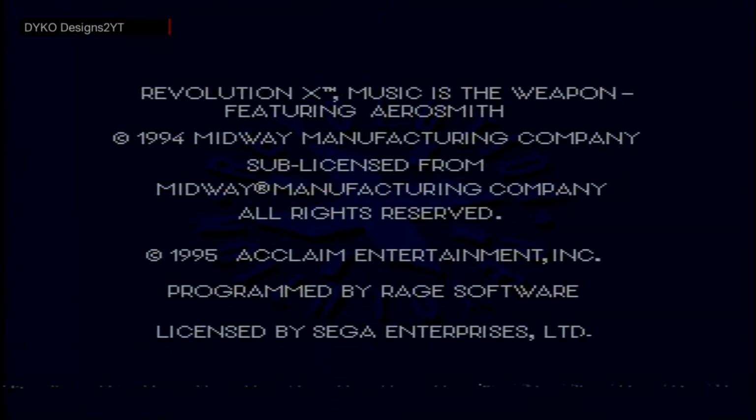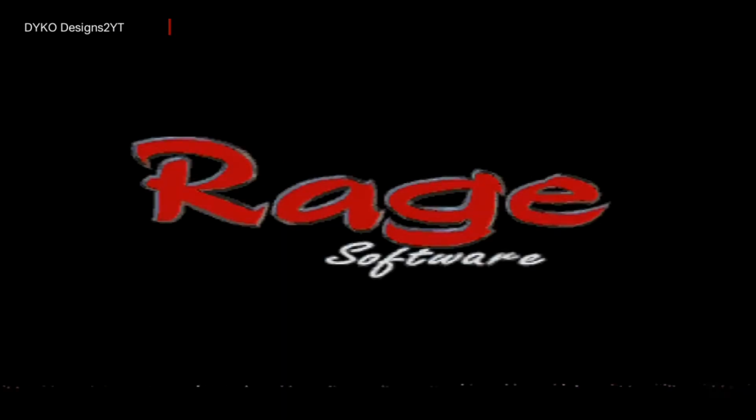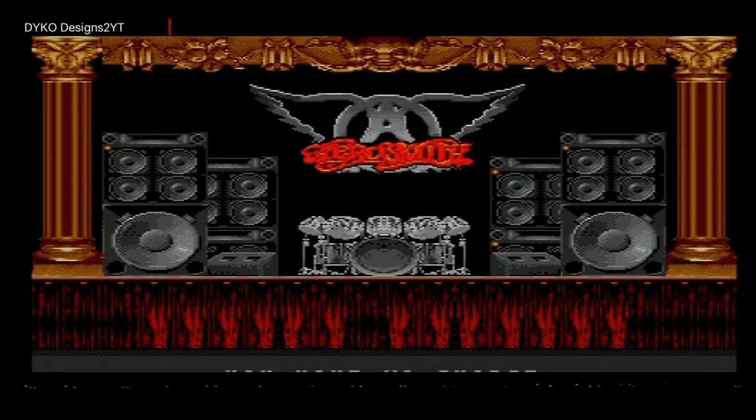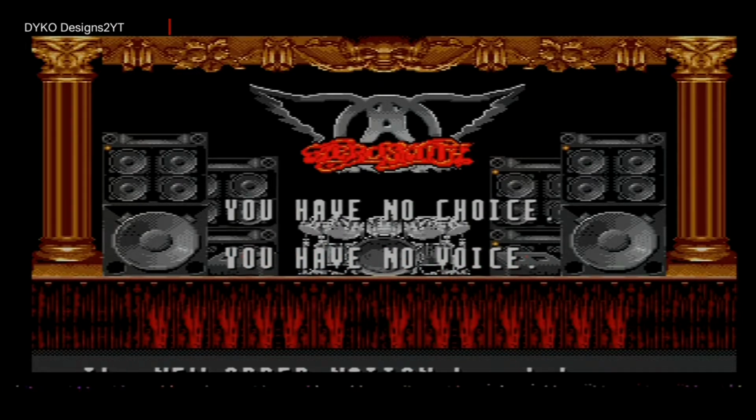And I don't really mind about the lag issues, because I use my CRT TV to play the game, and my Scart switcher has a dual output capability, because it's something that me and my dad designed and built, and I specifically wanted two identical amplified video outputs. So one Scart goes to the TV and the other one goes to the cheap Chinese converter. And as you can see, this is recorded through this method.